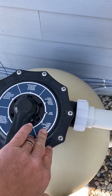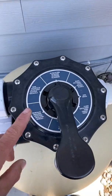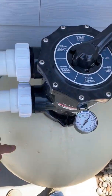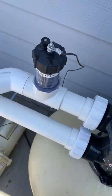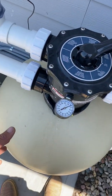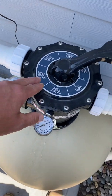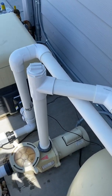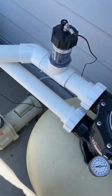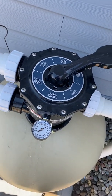Closed — never operate the pump while this is in the closed position. You'll never really need to use closed. Re-circ is another setting. What that does is it bypasses the filter completely and sends water right back to your pool. The only times you'd use re-circ is if, on the rare occasion, your filter is leaking and you need to still operate the system but not go through the filter. Or if you have to shock a pool, you put the shock in the skimmers, but you have to be on re-circ or else the filter will catch all the shock and clog up.